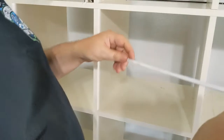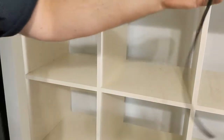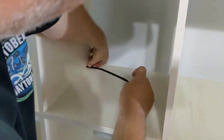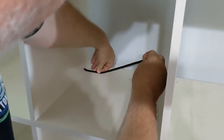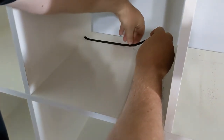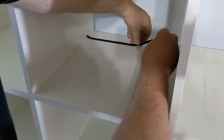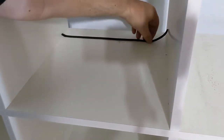So I cut the piece out like that — and now I have this piece here. Then I take off the backing. You probably don't need me to show you all this — I'm sure you all know how to put weather stripping up — but I'll do it anyway. I start over here, put it down, and try not to lift it very much off the line, because every time you pick it up off the cabinet it's going to lose a little stickiness, which shortens its life. So that's good — not perfect, but pretty close.